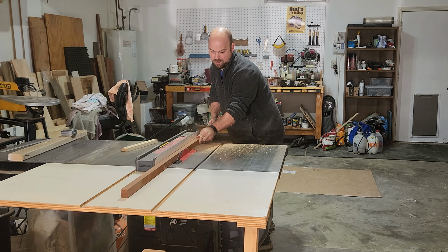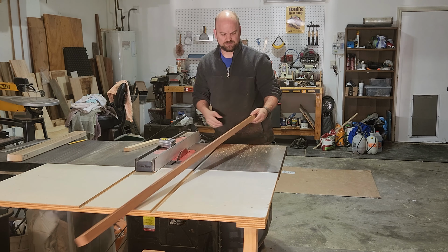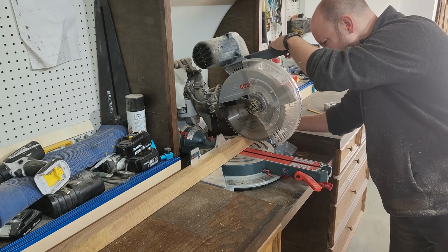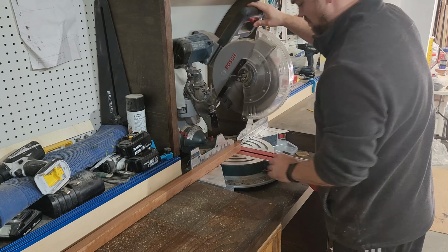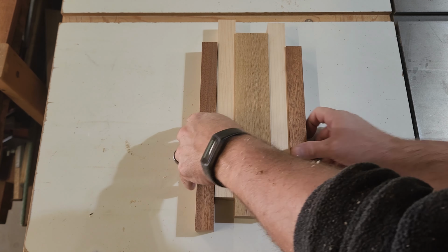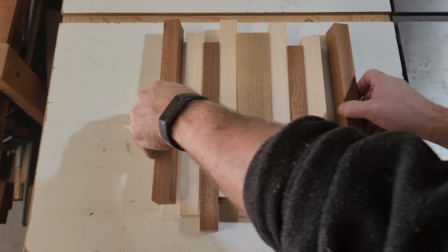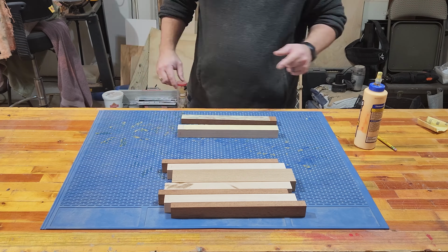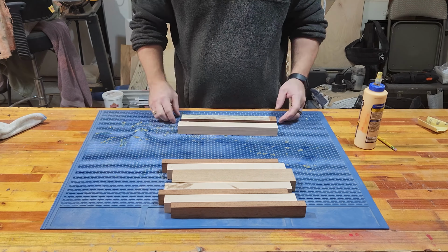Long grain is different than an end grain cutting board, where instead of cutting on the length of the grain, each piece of wood is set vertically so that the cut is on the end of the wood. Just think of a butcher block table when you think of end grain cutting boards. For durability and use, end grain cutting boards are far superior for heavy use and easier on your knife blade as well. The trade-off for that durability is that they do require slightly more oiling and upkeep. However, if your cutting board is only going to be used occasionally or maybe just for display, a long grain cutting board is going to be just fine.